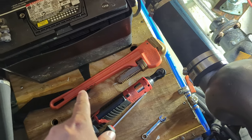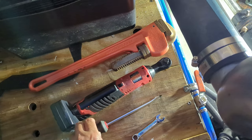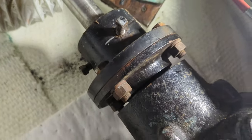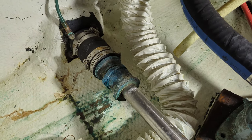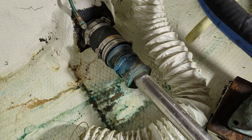The tools for this job: a big hammer, a spinning hammer, a pointing hammer, and a little hammer. We're going to start by getting the set screws out. I'm going to unbolt the coupler from the transmission and also going to try to break the jam nut loose on the stuffing box. Should be fun!